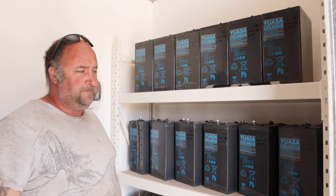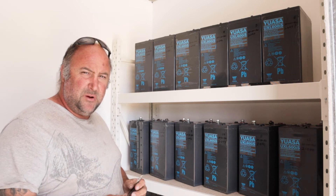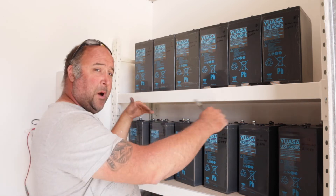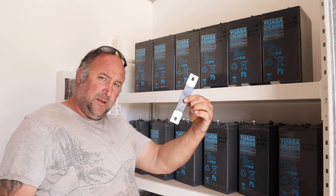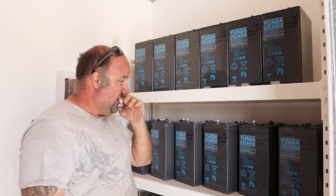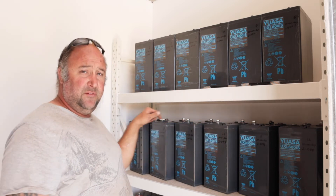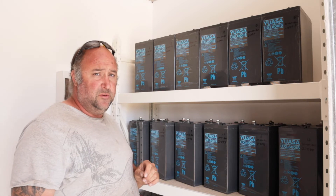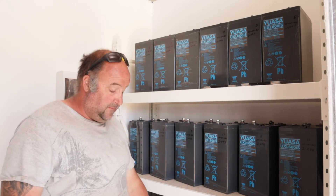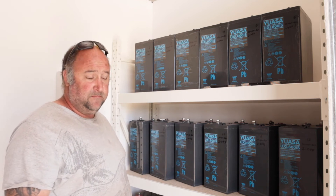Tested them all, they're all pretty good. Next thing we need to do is join them in series. I always get series and parallel confused, but what we're doing is basically converting these six 2 volt batteries into one large 12 volt battery. With these flat plates I will connect positive to negative, positive to negative, positive to negative all the way down, and that will give me 12 volts. If I joined all the positives together and all the negatives together I would still only have 2 volts but a lot of amp hours. So currently going 12 volt in series — each shelf is 12 volt and they will all join together to make 48 volt.